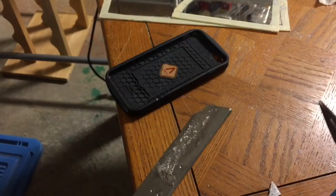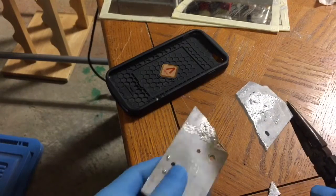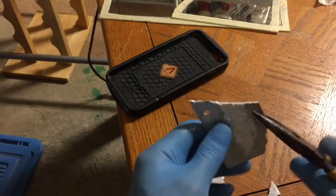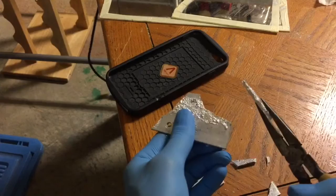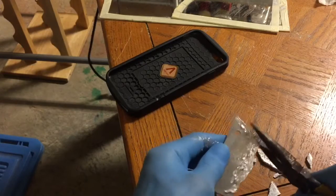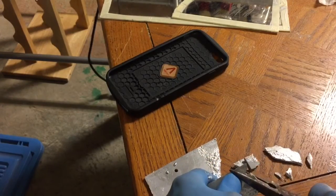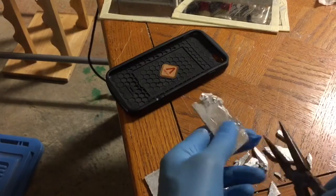This is a thick piece of pretty strong aluminum and it doesn't take a whole lot of force to just break it. It's become really soft to the point where I can just crumble it up with a pair of pliers with minimal force — it just disintegrates totally. The structure has been altered irreversibly by the presence of the gallium, and some parts are still hard but most of it has become totally soft.